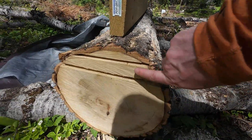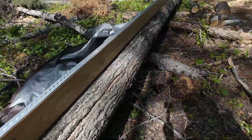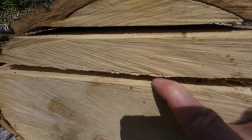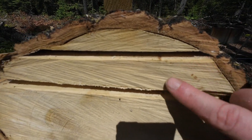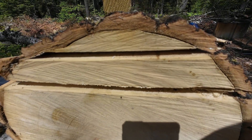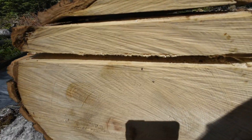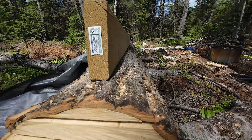I'm going to go a little bit deeper than this first cut to try to get rid of the scar, because there's going to be a scar on this piece. It's fortunate that with this bad cut from last weekend — if I go just a little bit deeper, this plank right here that I'm taking off will be almost two inches thick. So I can mill from there and then pull my beams out from the rest with the edge mill.